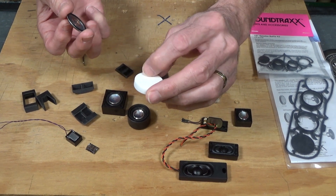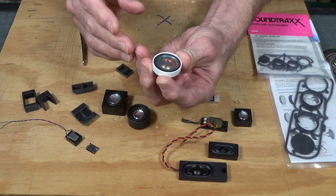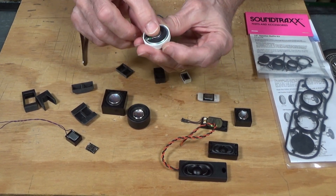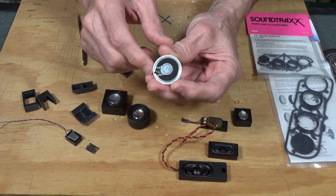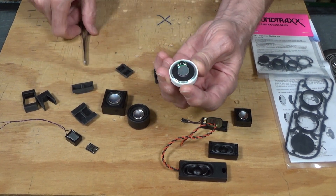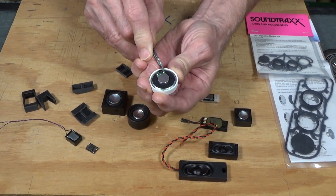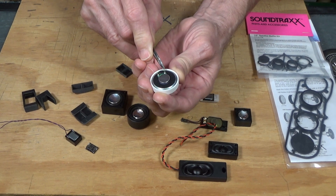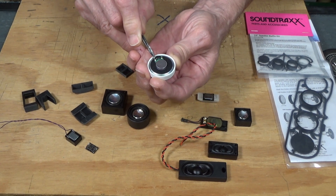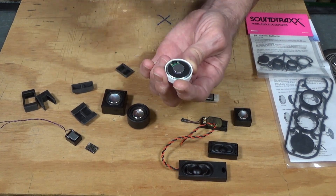This particular one is a TCS speaker. It's 28 millimeters in diameter, 1.1 inches, and you can get this enclosure for it. It's a plastic enclosure with two holes on the back for running wires through, so you can mount it with the cone facing out or facing inward. I kind of like doing it inward because it protects the cone during the installation process from rubbing wires and things of that nature. On the side of the speaker, there are two little silver dots — these are the solder points for wires from your sound decoder. They're already pre-tinned, so you just tin your wires and hit them right there, and you're done.